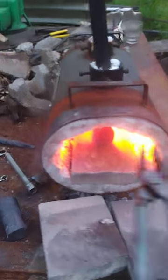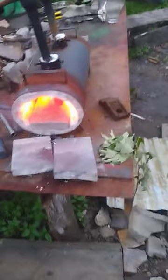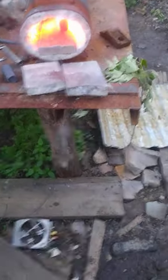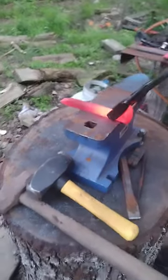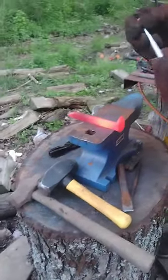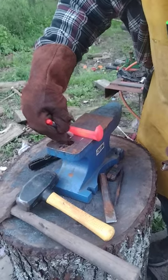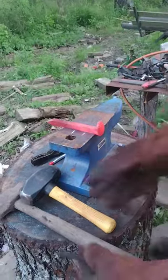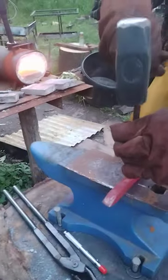You can see this spike's taking a little bit longer than the others to reach temp, so he'll have to be in there a few more minutes. But in the meantime, I can at least set my holes. Now, he's still too cold to start forging, but what I can do is take my soapstone and measure out a gap of about what I want my hole width to be. Take my little four-pound hammer and I'll line it up right there — set a divot.